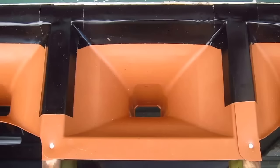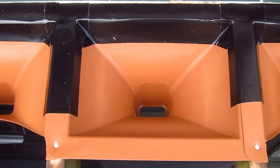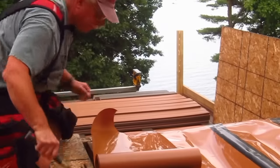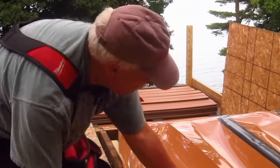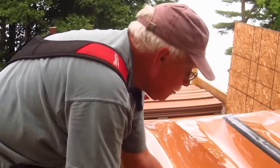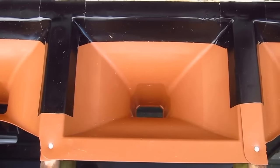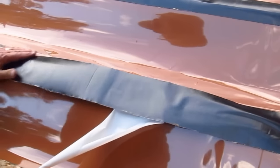It puts the water into these really cool funnels, and then you simply capture that water and treat it as you would any water that's coming off your roof. The components of the system are really pretty simple — just these sheets of vinyl that create troughs inside the floor joist bays, and then you have these giant funnels that the water is directed to.